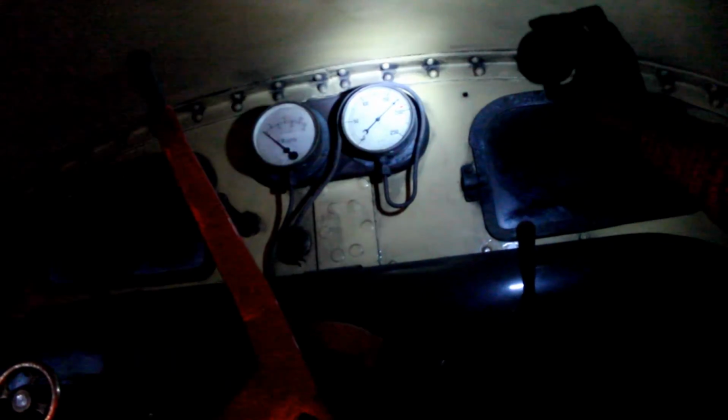There's the water there. See the water bobbing up in the glass? Yeah. There's only half full at the moment, and that's the pressure gauge, so it's almost on full pressure. Oh, right. Yeah. What's it run at then? 150, is it? Oh, it's over. 185, I think, this one's set up. Blimey. So that's what he's on 170 now, and 175 now. So the red line is what he's he'll blow off at. Should blow off at. Oh, right.